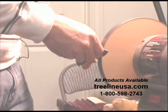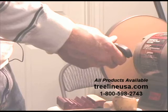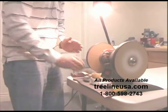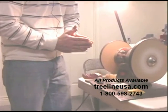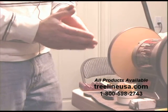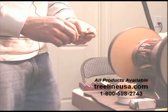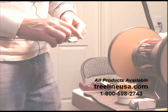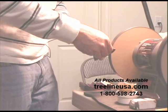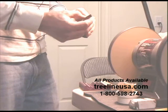Normally, depending on the hardness of the steel, how dull the knife is, and some other factors will determine how many passes you actually need to make. A wire edge is where your two points have met and it pushes a little bit of metal onto the other side, creating a little bit of a burr. Once you have that burr or wire edge from one edge to the other, you want to stop on this wheel and come over to the polishing side. Normally you can feel that wire edge. Now I can feel it from one edge all the way to the other.